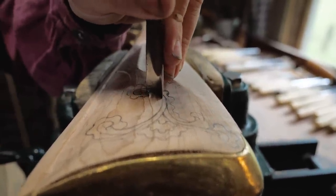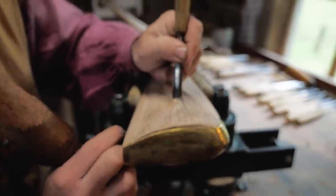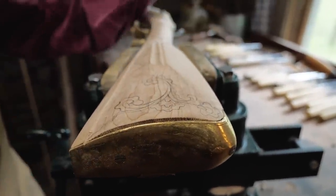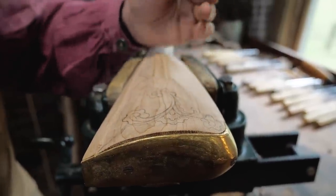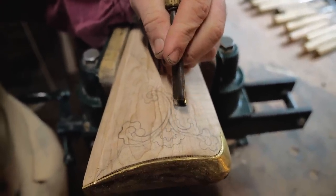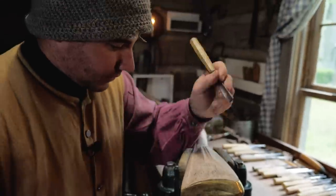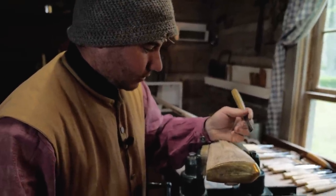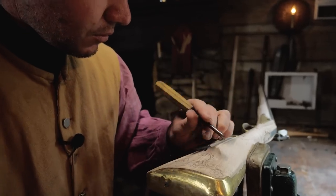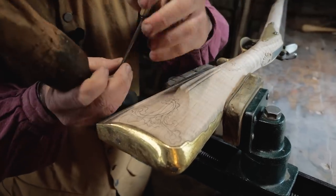That chisel is following the line pretty well, so now we'll take the mallet and start. All the decorative wavy lines on the outside are going to go away when I shave this off — I just drew them on so you can see what the carving will look like when it's done. These lines will be incised carvings and this will be relief carved. Keep in mind how hard you hit your chisel to maintain consistent depth, and just keep alternating chisels as you go to fit the angle.